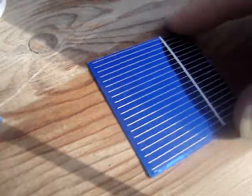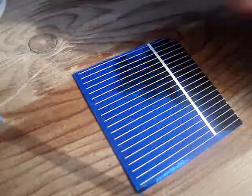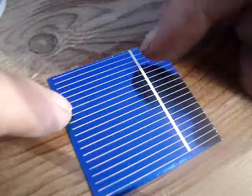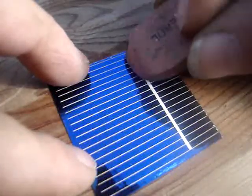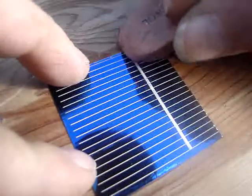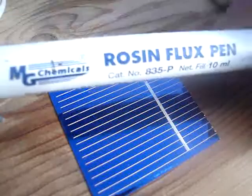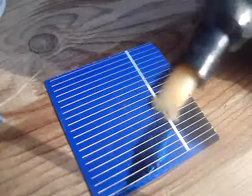Here's a two by two solar cell. I take a little eraser and on this white stripe right here I expose the little copper line — doesn't take much erasing at all, just like that. Now it's exposed. Then I take a rosin flux pen — mine's a little worn out at the end because I use it a lot.